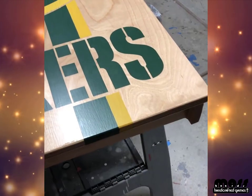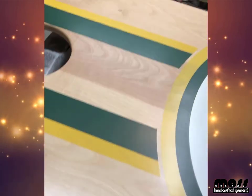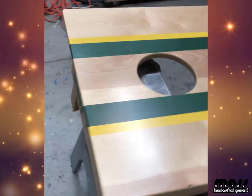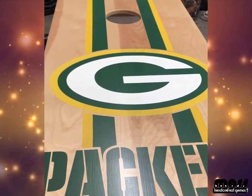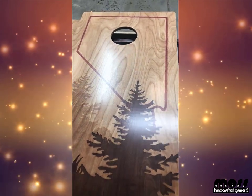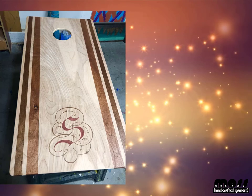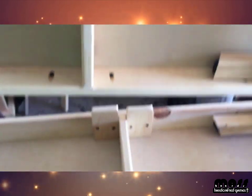If you're producing enough boards to warrant spraying with a clear coat, go ahead and do that. I had some bad luck with a sprayer and I only make a couple of sets each month, so I just use the white foam brush — works out great. Here are a couple more examples of the finish you're looking for. If you see any dull spots after they're done you can just hit those with a couple more coats. The clear coat really brings out the wood grain.